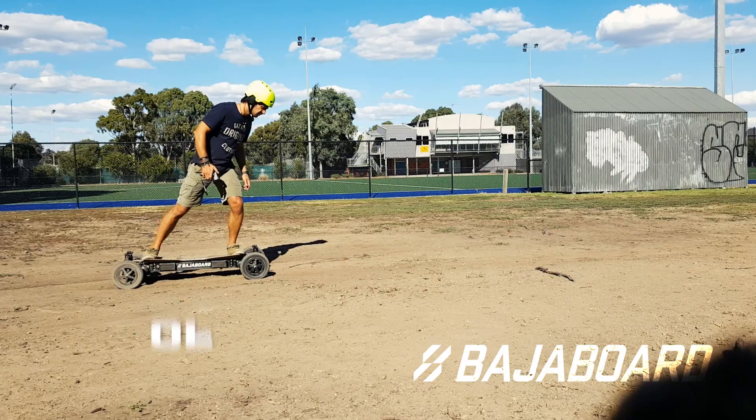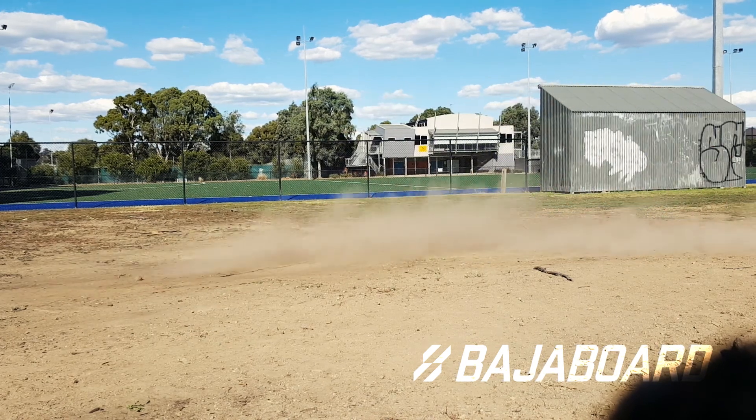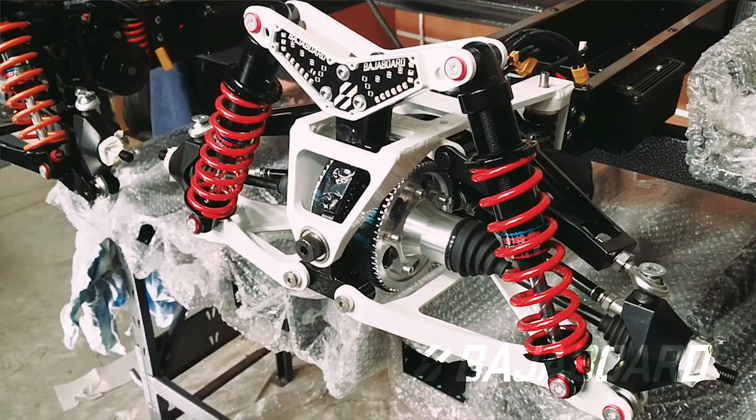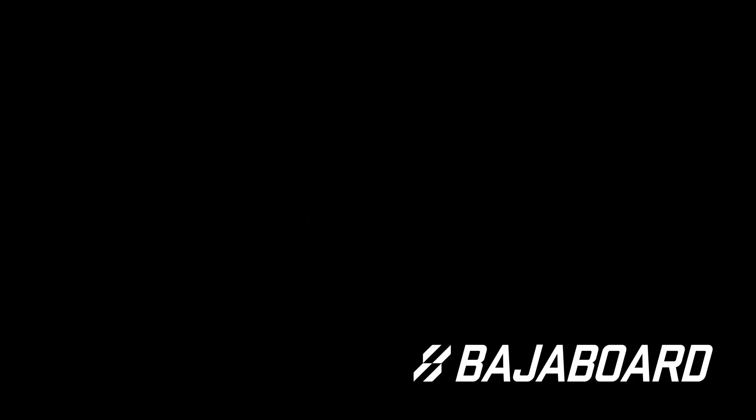The most critical thing about battery sag is if your pack is already below and close to empty, and you request a lot of power from it, then potentially the voltage can drop below the safe low voltage cutoff. If you have a battery management system — a BMS — it could cause the battery pack to completely cut power, so if you're riding a board it can just cut out. If you don't have a BMS, it's not good for the battery either; it can drop below the low voltage cutoff and potentially permanently damage your pack.